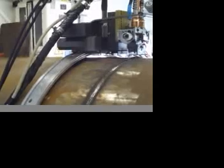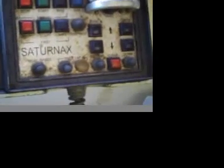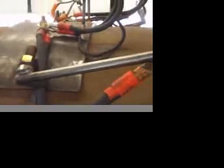It's 625 wall. We have six programs in it. So number six is your capping program. Number one being your bead hot pass. Second is your hot filler. Third is a filler. And you have fourth and fifth that are strip passes. That's a cap right there.